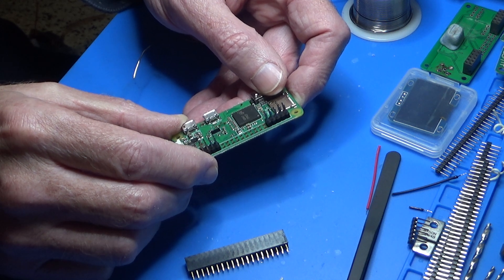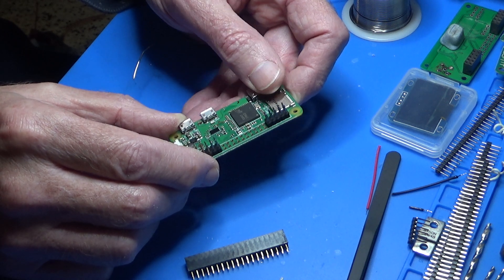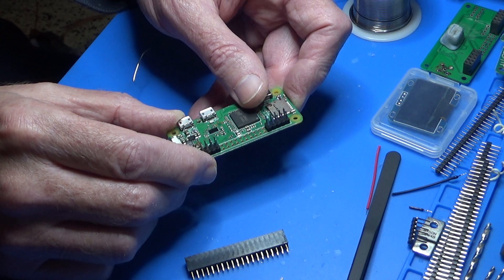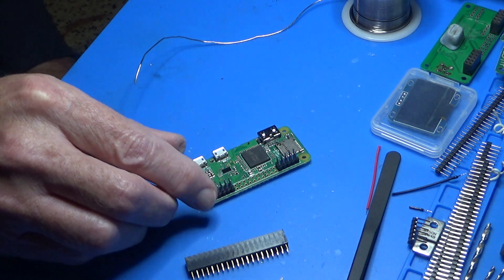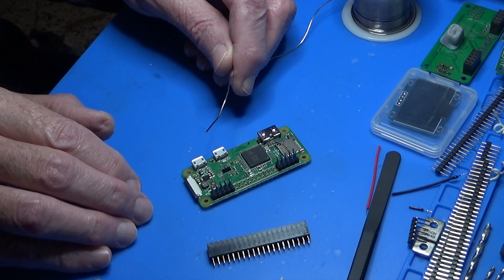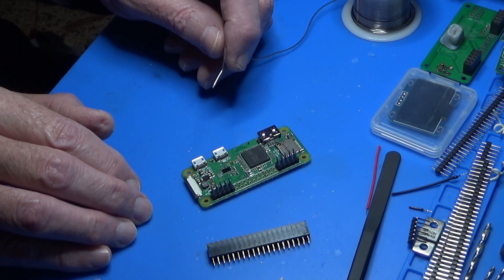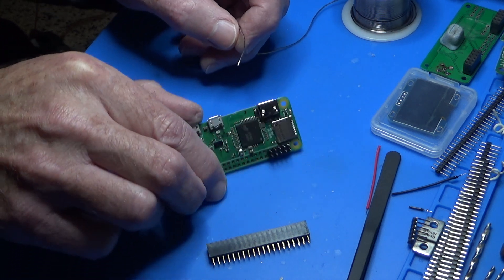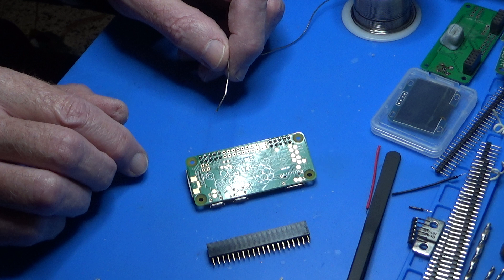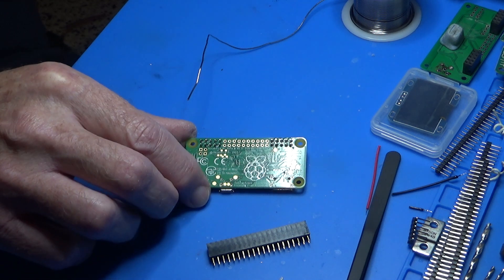I've been building hotspots since 2019. When I started I wasn't particularly good with soldering — I was a bit shaky and a bit out of touch, hadn't done much soldering prior to that for a very long time. So I slowly geared up with bits and pieces on the bench to make the job a little bit easier. I'll talk about the solder — it's 0.8 mil. I recommend that you use 1 mil or lower. 0.8 is a nice sweet size for doing the small work — for Raspberry Pis and modem boards and that sort of stuff. If you go too big, 1 mil is probably getting a little bit too big. 0.6 mil is a bit too small as you've got to feed a lot of solder to the work. I think 0.8 is a good selection.